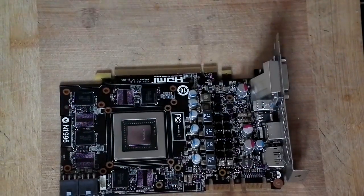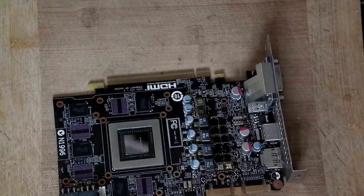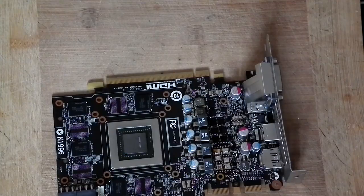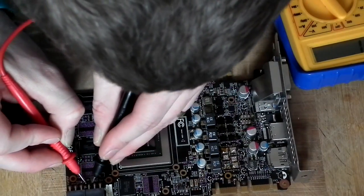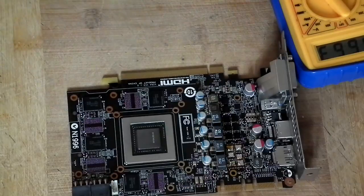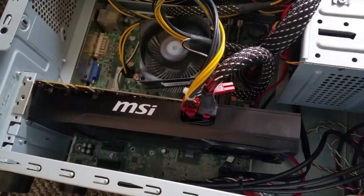Okay, we have two off and I'll try to check if it's still short there. I will try to continue removing another two, and hopefully we can find them. We have all six out, and hopefully it's the correct side — hopefully I'm not making a mistake. No, I think the short is not there anymore. Yeah, I think we've removed the short. I'll double confirm with a test. The card just needs to cool down, then let's go.